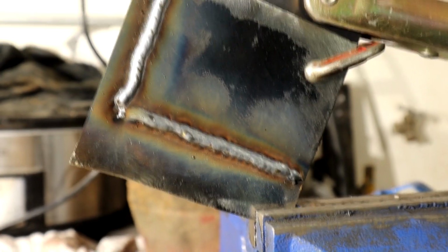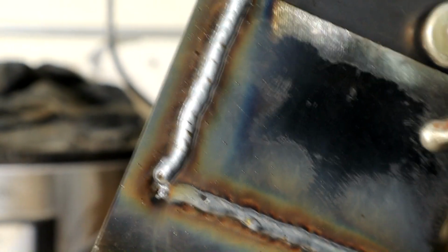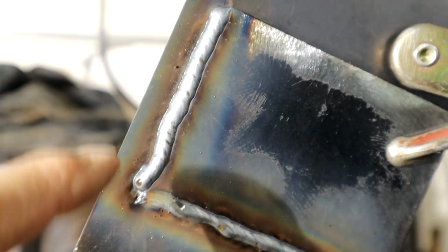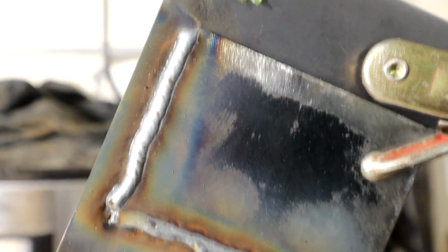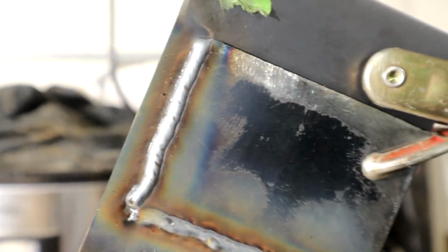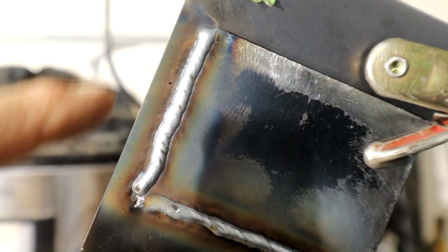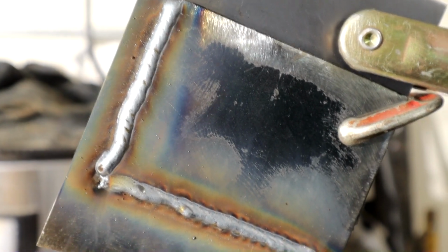That bottom one is the one that I'm simulating, kind of welding upside down. And that one, that doesn't look bad, that one. Little squirrely at the end there, right at the bottom there, but generally that looks pretty neat actually. So if we could come close to that all the way round, that'd be all right. That, and any deviation I can always clean up, and it's going to have a seam sealer, I think, round, to make sure no moisture gets in behind.